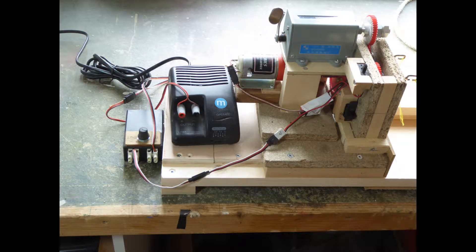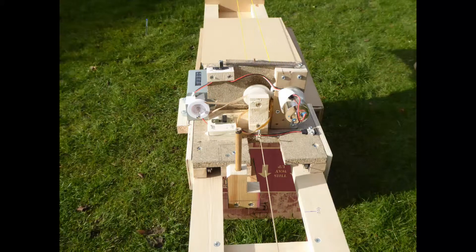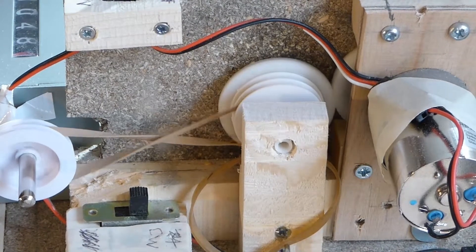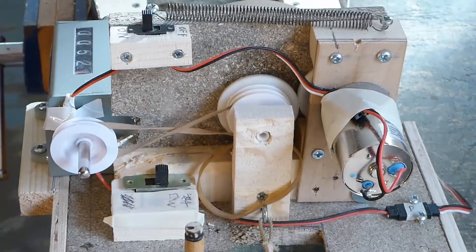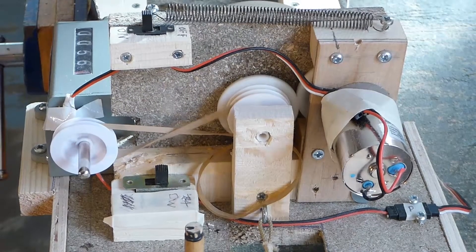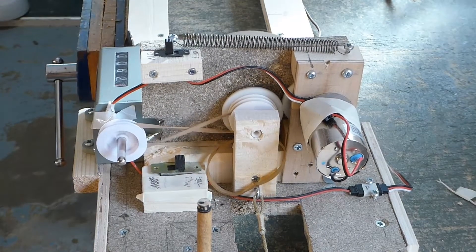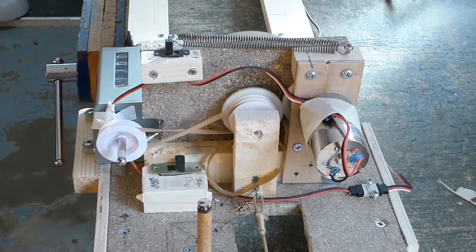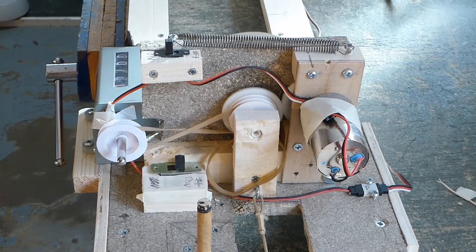The rope twisting motor has a 1 to 30 geared motor supplied at 12 volts. The two white gears rotate the disc at about 300 rpm. The white gear is not attached to the motor correctly as it wobbles, so the whole motor-gear assembly is free to move and a spring keeps the two gears engaged. Though not planned, this ability to move the motor allows the gears to be disengaged, allowing the disc to be turned by hand to make it easier to loop the threads.